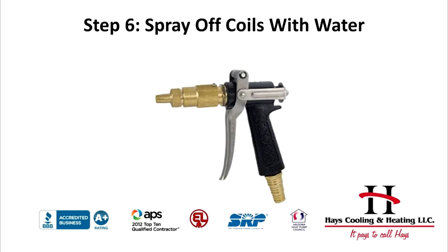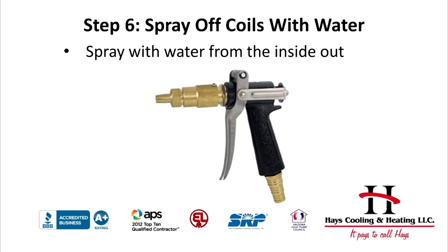Step 6. Spray off coils with water. This step can be done in several ways. However, the easiest is to grab a hose with a high-pressure nozzle and spray the water on the coils from the inside, pointed to the outside. This will remove compacted dirt from the air conditioner coils. There are some biodegradable foam cleaners that you can use, but it's recommended to let professionals handle this step.